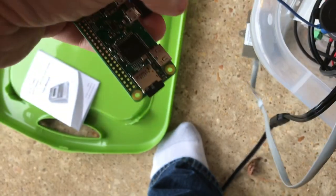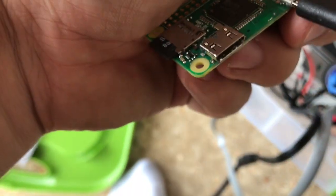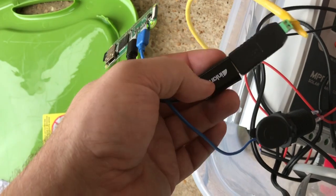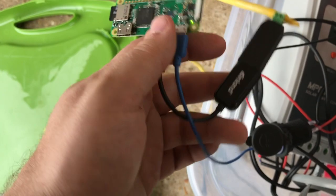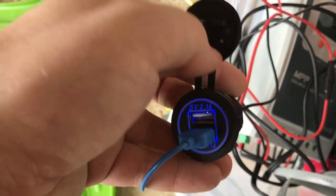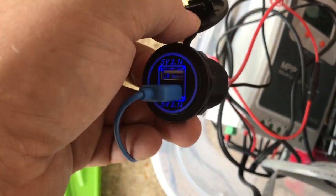You can put an HDMI cable in there, but you're going to need an adapter because it's a mini HDMI. The other trouble I had was the USB — I had to get a USB adapter that goes to a female connector so I can plug a regular USB device in. And then I had to buy this 12-volt USB port, and you want to make sure you have 2.1 amps for the Raspberry Pi.